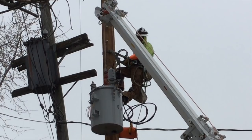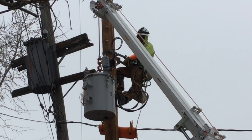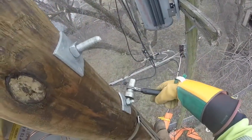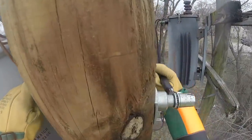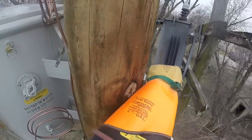About 15 minutes later, you see a lineman climbing up this newly set pole. They're going to swing around a three- to five-hundred-pound transformer that's going to hang on this pole. The expanding foam set quickly enough that just 15 minutes later a lineman can get up and work on the pole — that's a big advantage in storm restoration situations or accidental damage.